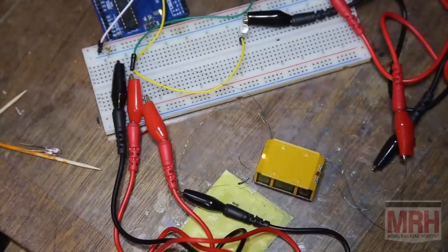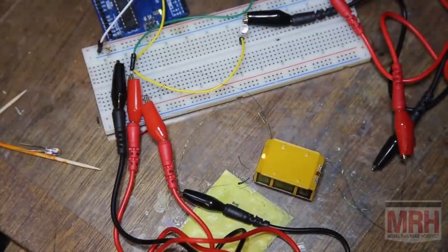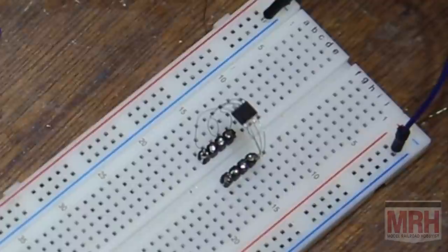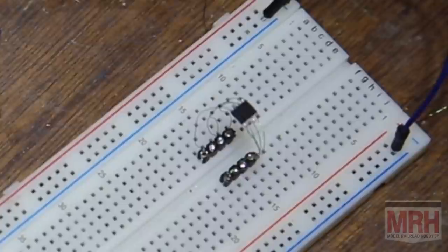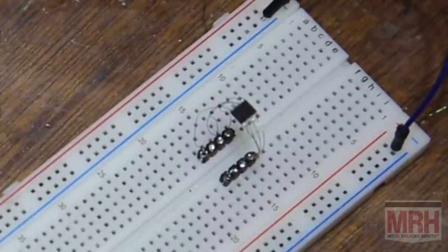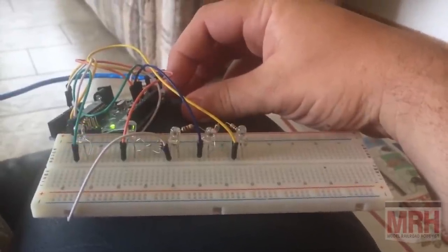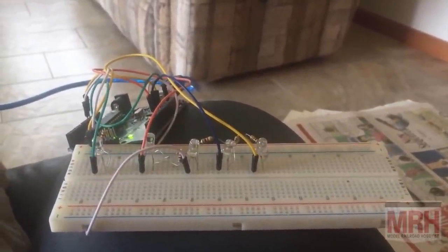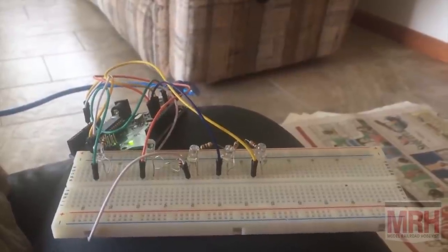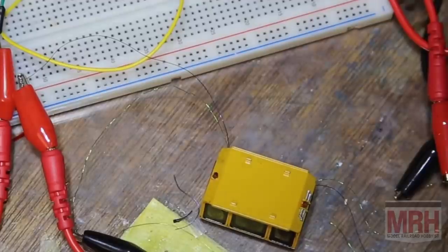The strobe lights on a locomotive are normally controlled with one switch. Therefore, it would be an ideal usage for the ATtiny13 chip, a microcontroller with up to 6 programmable pins. It uses the same programming code as an Arduino, and a properly configured Arduino can be used to upload that code from a computer. So first, I had to hash out the strobe flash sequence on the Arduino before I could upload it to the ATtiny13. I wanted to program a sequence for 2 LEDs so that they would each do a double flash, be off for about a second, and repeat.